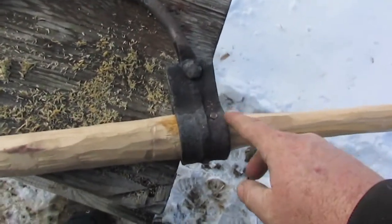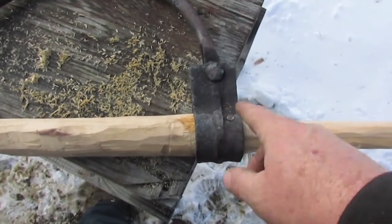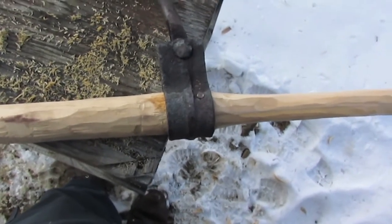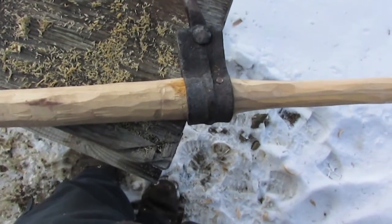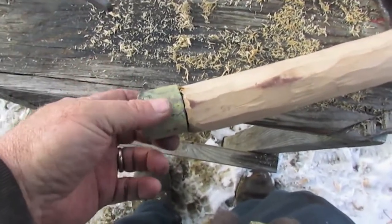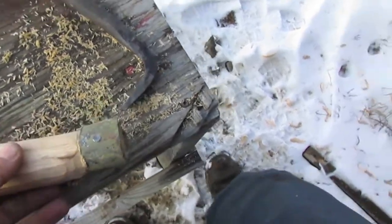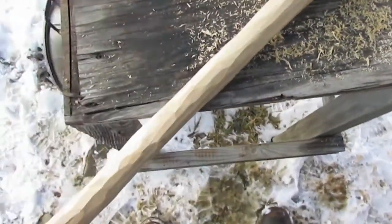I pinned this in. I kind of modified a common nail, squared it up on the anvil, and added some barbs, basically, just to hold it in. And then this is just — I drilled a through hole and then put another common nail through here, and just cold riveted that on. So that's not going anywhere. It's basically done. I did a little whittling on the handle.